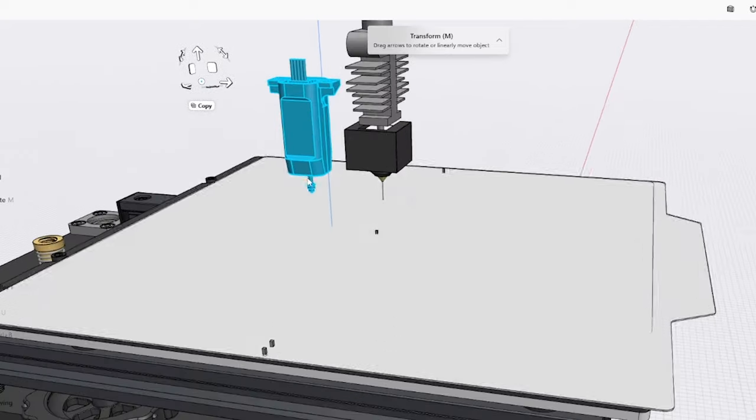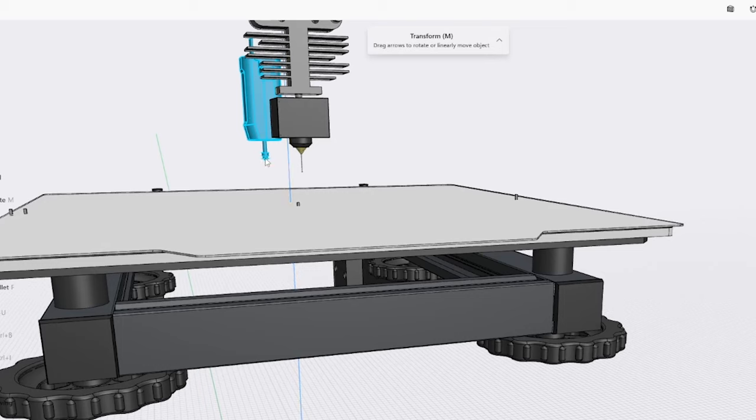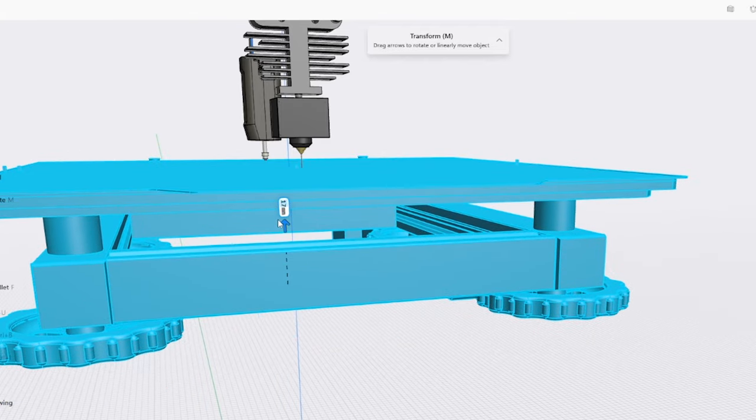So how do we deal with a print bed that may have some degree of tilts and minute ups and downs throughout the entire surface? You can just fight with it, shimming with a piece of painter's tape here and there, but if you'd rather not fight with the printer quite so much, take my advice and buy a printer with automatic bed leveling or add it later. The most common options for this are the CR Touch or BL Touch devices. This device is added to the printhead relatively close to the nozzle location. The auto leveler works by dropping a probe down below the nozzle to touch the print bed and take a very accurate height measurement. At the start of a new print, the printhead moves around and takes measurements at 16 to maybe 25 points along the print bed in a grid-like fashion — either 4×4 or 5×5.